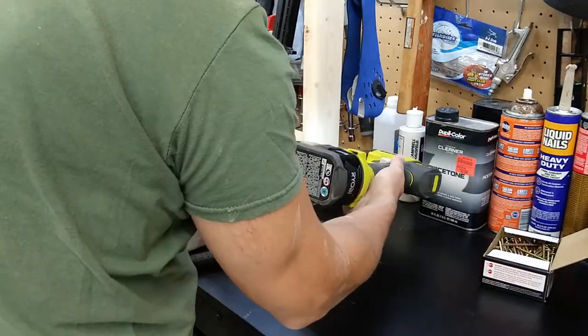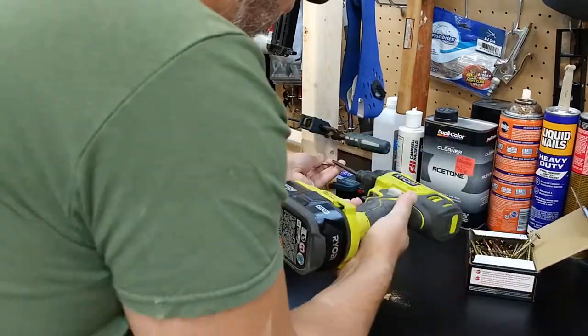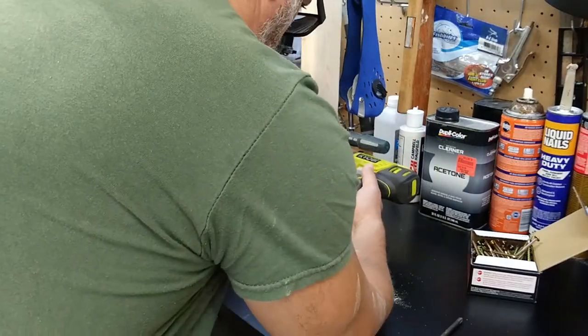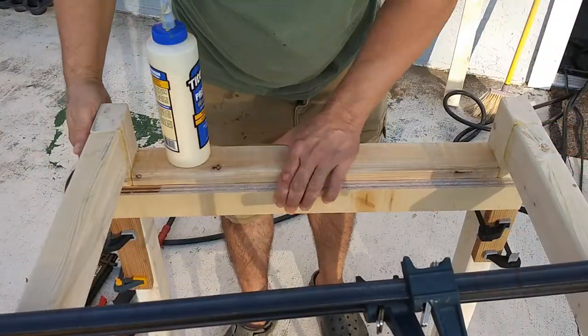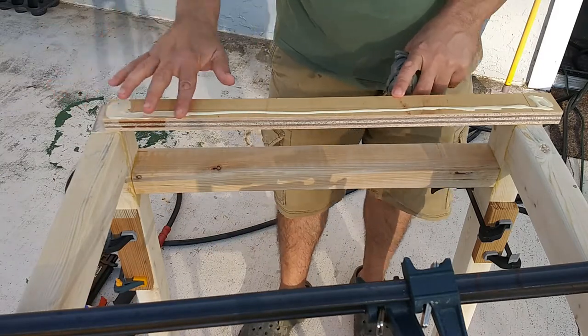As far as the deck is concerned, I made the assembly complicated for no reason. That is because I decided to use the cutoffs from the wings, which are only 18 inches, instead of the 20 plus required to bridge the deck from front to back. At first, I thought of using dowels, but I opted for a piece of 3/4 inch scrap to make a step where the deck board will rest.